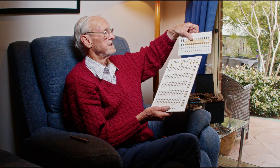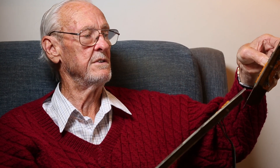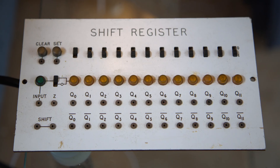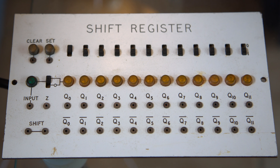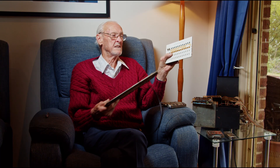Here's one of the registers, an accumulator, and that of course was completely wired. You didn't have to actually wire up a register — that was ready to be used and it just had clear, set, and clock inputs available to drive it. There was no interconnection between the registers. These had no interconnection with the other modules, of which there were about six.